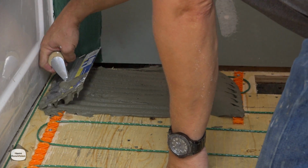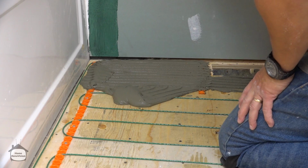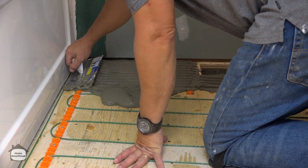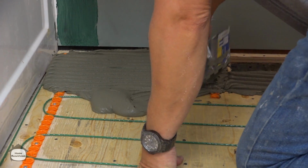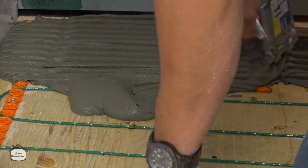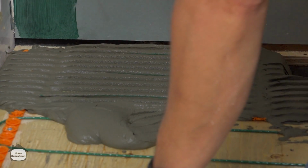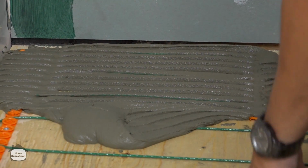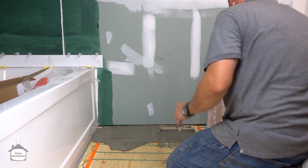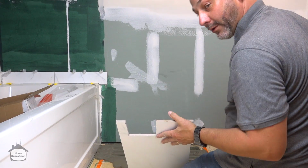Oh, that's a really nice cement. We are working with an electric heating cable system. And we've installed the cable in the same direction as we want the length of our tile to go. And we're doing that for a reason. So we can actually set our trowel over top of the cable and create these really awesome 1/2-inch grooves. And the reason we want such a very pronounced groove is because we're actually setting above a heating cable without using a floor leveling system.